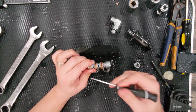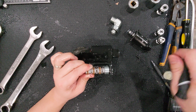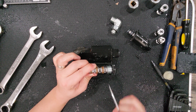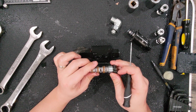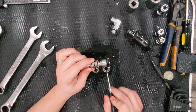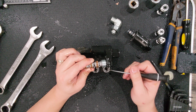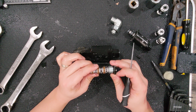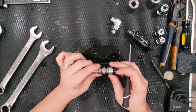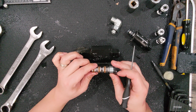As fluid comes in, the steering probably rarely has much pressure. The pressure relief valve of the orbital control, which is the thing the steering wheel is connected to, is like 1,000 PSI. So you're never going to run more than 1,000 PSI between this and the steering, or it's going to bleed off to the tank. On this side, the pressure is determined by your SCV for your loader, which comes factory 2200-ish. Some of us have been known to turn it up to around 3,000. And your backhoe, I don't know exactly what it's set at. I don't have the tech manual for that, but I suspect it's higher than 2200, probably not quite 3,000.